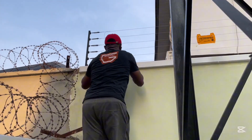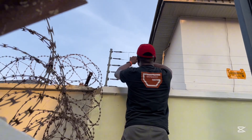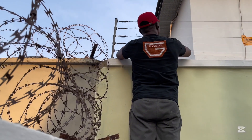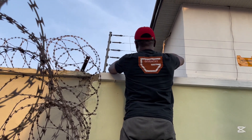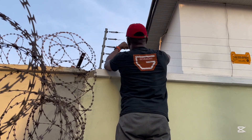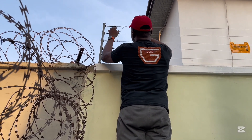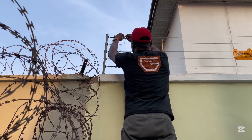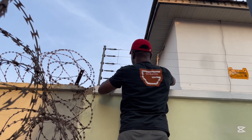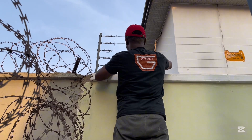In this scenario, the energizer is at one end and the fence stops at the other end — it's really straightforward. You don't need much technicality. If you understand how to loop, just go to the extreme: close line one and line three, then close four and six. For a straight fence — assume it's a linear fence — just go to the end, put one loop of one to three, then four to six. That's it.